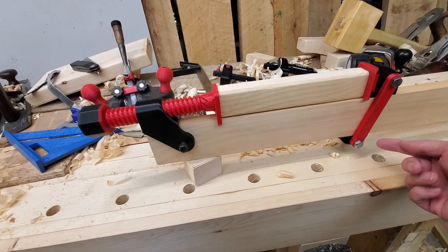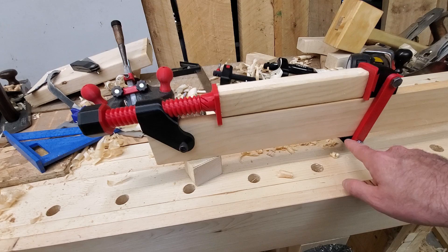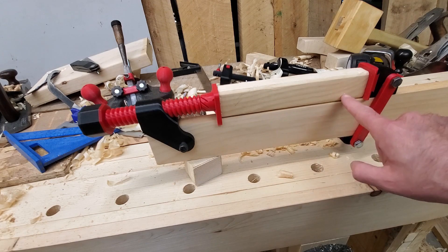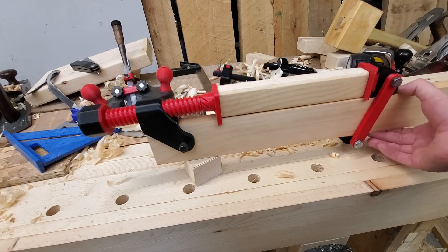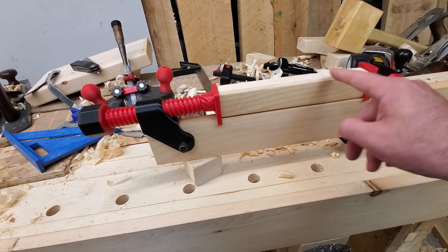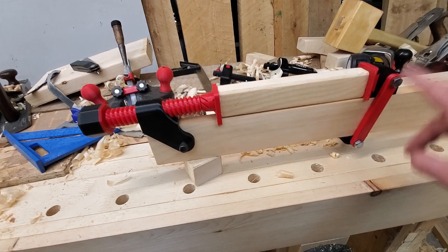The angle of this connecting rod is important. There's a bit of sandpaper stuck to the bottom of this foot, and when the clamping pressure comes on, this grips just enough to cause it to cant over and bind on the beam. You can apply a tremendous force with the screw, and this won't move.